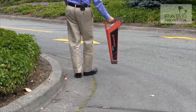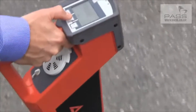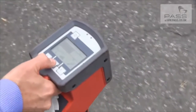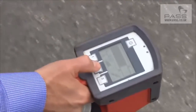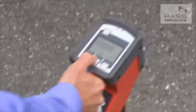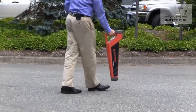And we'll just zero right in on that wire. When the signal starts to drop, we know we've gone past it. I'm zeroing in here on this wire — it's right here. I will just use this motion to continue staying right on that wire, and this will lead me right back to the transformer.